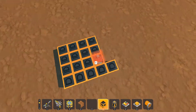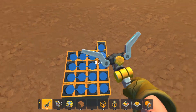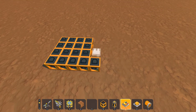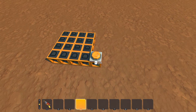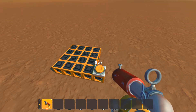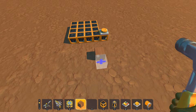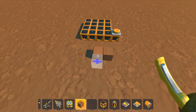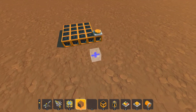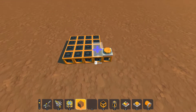Whenever we hit the input, we want this to flip. Because if you look at the pattern — 0, 1, 2, 3 — this always toggles. It's a 0 now, it's a 1 now, it's a 0, and it's a 1. So it's always going to be either on or off depending on the last sequence, just toggling from that.